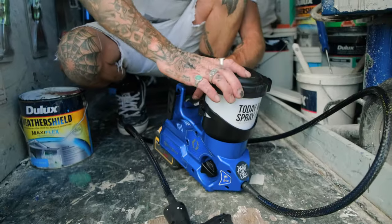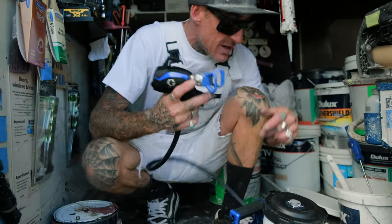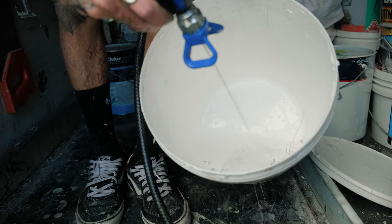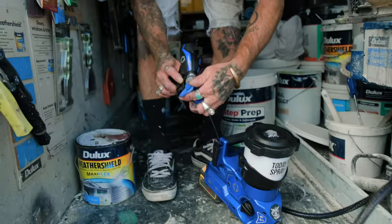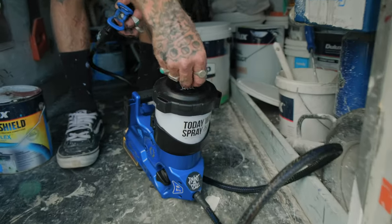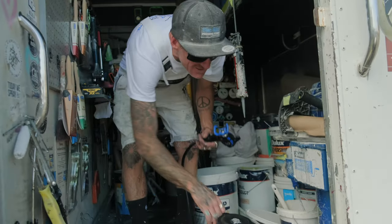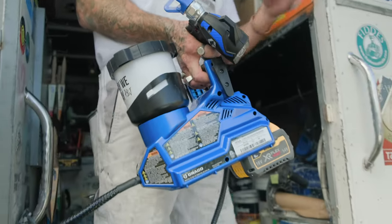We can put the lid on. Because we're still in spray mode and haven't really put air to it, we should be right to go straight away. This is just our undercoat so it'll be a bit of a different shade. I can put the tip in reverse — it keeps it airtight on this end. We've put the cap on here, so it's sealed up. No air going through the gun, no air going into the cup to dry out the paint. We can go inside, sand everything, dust everything down, and go straight into spraying the woodwork or the Dulux One Step prep.